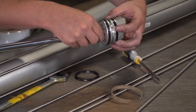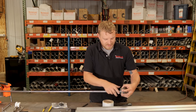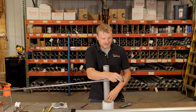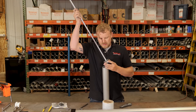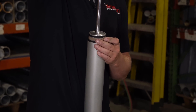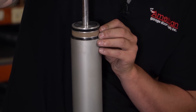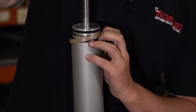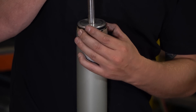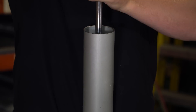Now we've replaced the U-cup on that one. With my new U-cups on, I'm going to replace this seal here. I'm going to take this tube and set it on the floor — makes it a little bit easier to hang on to. I'm just going to start slowly pushing this back in. You do have to be careful to make sure that U-cup catches the end a little bit so it goes in there properly. Put this little seal on here and that's it.